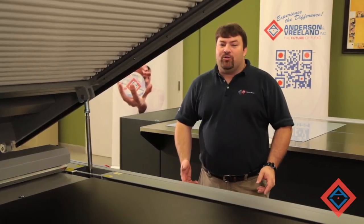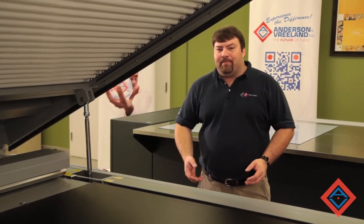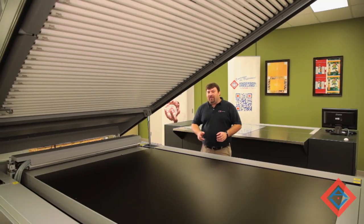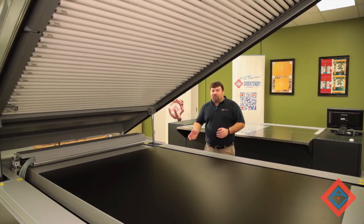Flint Next, or new exposure technology, is a way to produce a flexographic flat-top dot plate. It uses high-energy UV LEDs to promote rapid polymerization in the flexo plate.